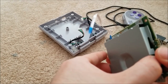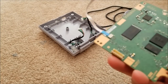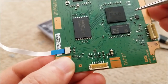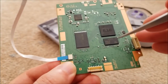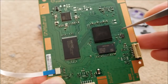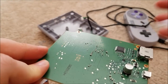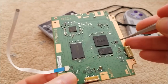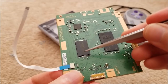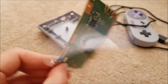Carefully removing the board — there's a thermal pad that goes into a divot and sits right on the main processor, which is an Allwinner R16. The associated RAM is very close by, and you can see the traces. There are some tiny squiggly impedance-matching traces — those probably head toward the HDMI interface. Here's the main crystal oscillator for the chip along with its capacitors.